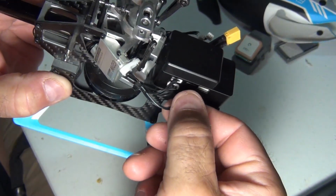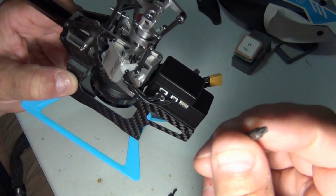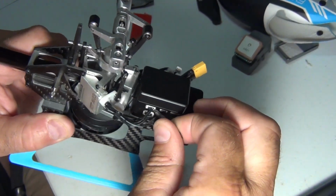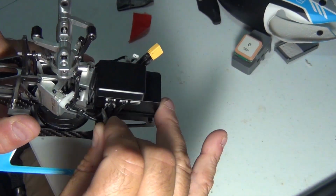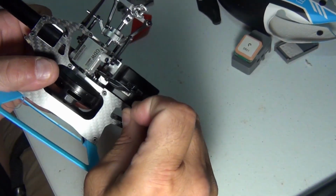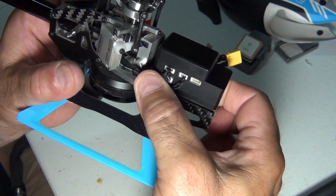And here's the three pin. Pins at the bottom. Check your wires, make sure you didn't pull anything off. What I would recommend is get a blunt, small tool and just push the connectors, but not on the wires, push it on the plastic, because even with your fingers, you can't quite get them flush. So you want to make sure that they're all the way in. You don't have to push hard, but even if you just use the blunt side of the bit. I'm using a little bit here. Alright, so that's those three. I think I'm going to put a little teeny piece of tape there to hold this all in here.